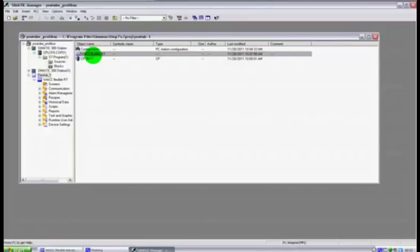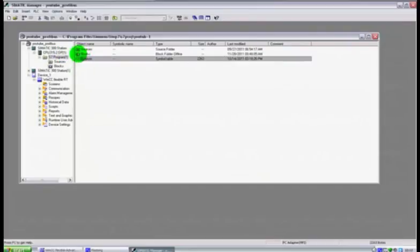I hope that's been a bit useful. I tend to use this a lot and integrate everything. I wouldn't worry too much about the project getting too big. If it gets so big that you can't fit it on a CD, then okay, I appreciate keeping everything separate. But to be quite honest, this does help you a lot, and we'll see on the next video what that has done for us to be able to integrate this symbol table from your PLC into being accessible by WinCC.